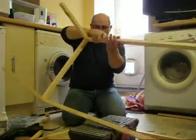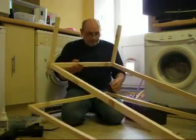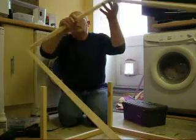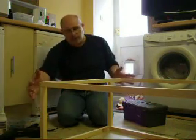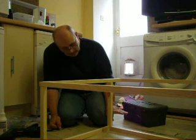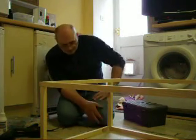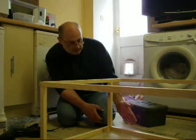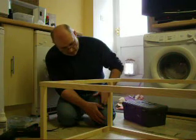Now what I'm going to do is put the other bit on — this is actually the top section, and this bit will be the bottom eventually. There's a slight projection here, so it's wider at the base than it is at the top. The reason for that is I'm going to have to sink part of the work surface — the top of the cushion base — slightly about four inches, so that the cushions can sit behind. The back of the cushions will slot behind because they're quite high cushions. By doing that I can actually make a hidden little cubby hole at the back — a hidden storage area, about six inches wide, about 400mm deep.